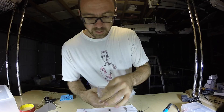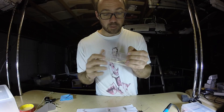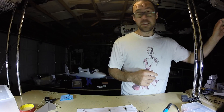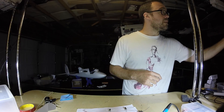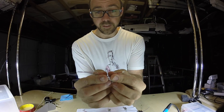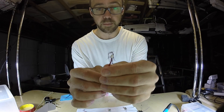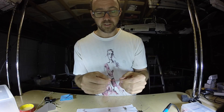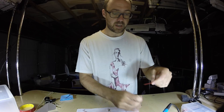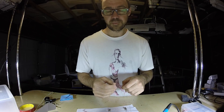So I bought some of the plugs and everything you need, but it's such tiny handwork to crimp them. I was having such a hard time and I have really shaky hands. So until I learn how to do that better, all I've been doing is buying a pile of these JST pigtails. This is the plug you need — the two pin JST micro plug for the motors. I trim them and connect them to the motor wires with some shrink tube, and it's good enough for me.